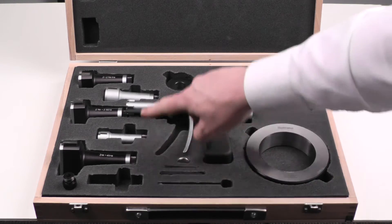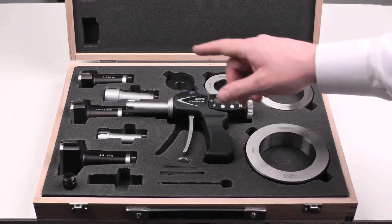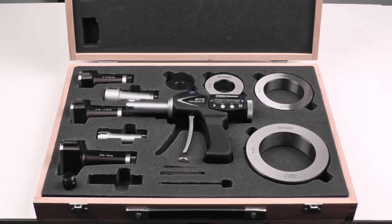You'll see there are six different measuring heads and only four master rings to service these. That's done by spacing the rings so that they are staggered every other head, so one master ring can service two different size measuring heads.